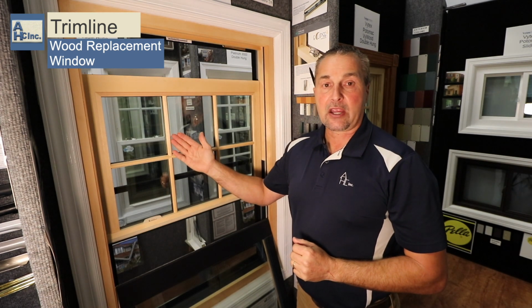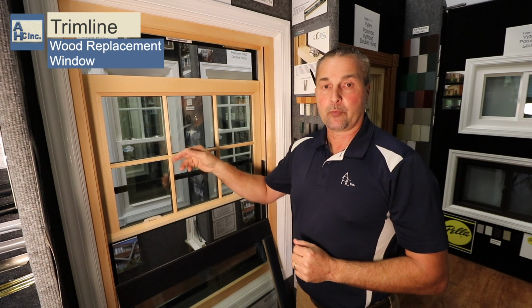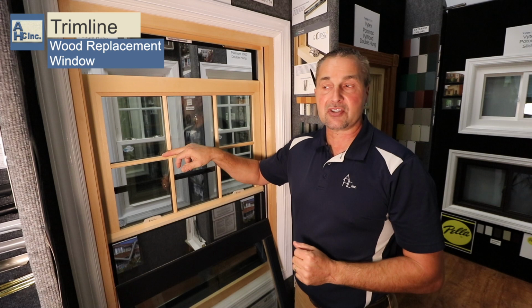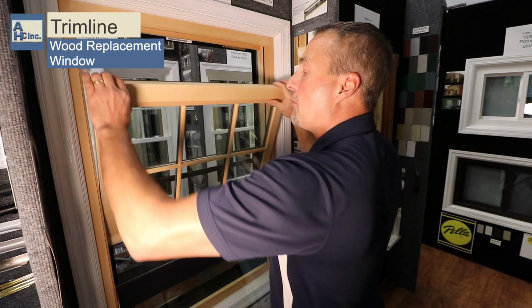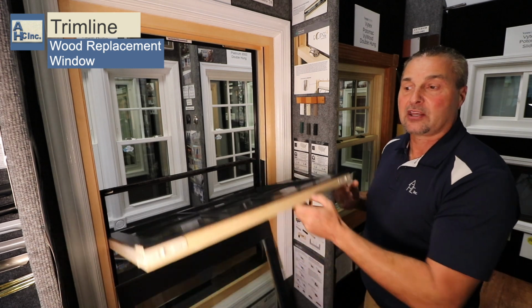The top sash is showing you a simulated divided light grid. That means you have a grid on the interior that's non-removable, a grid in between the glass that's inside the glass so you can't touch it, and then it'll have a non-removable grid on the exterior. So it gives you a truly divided look